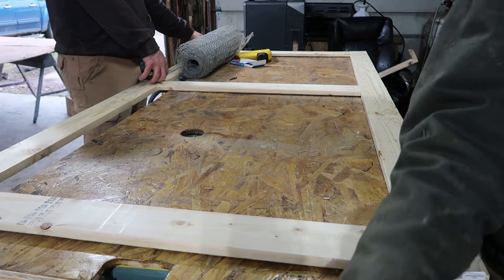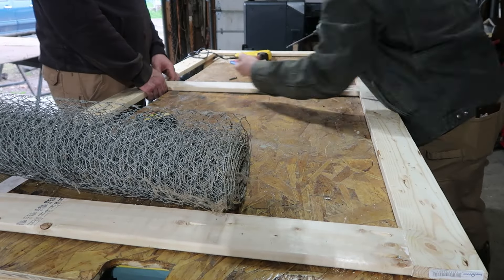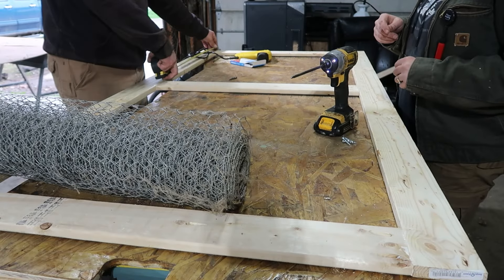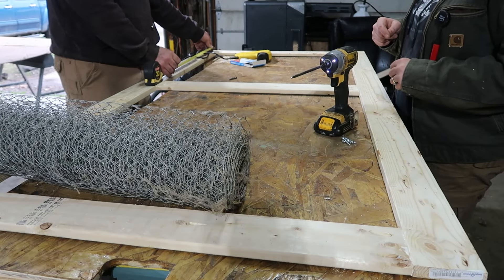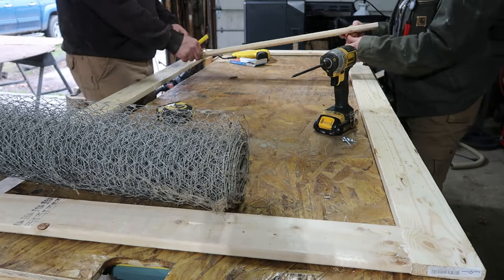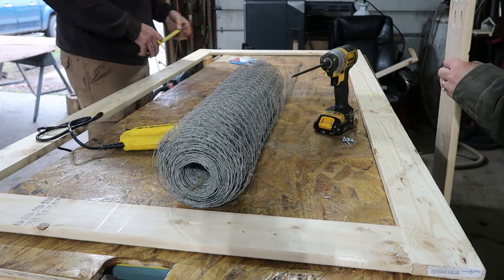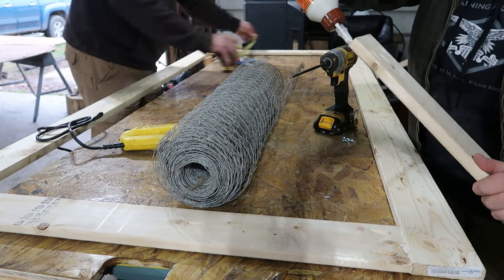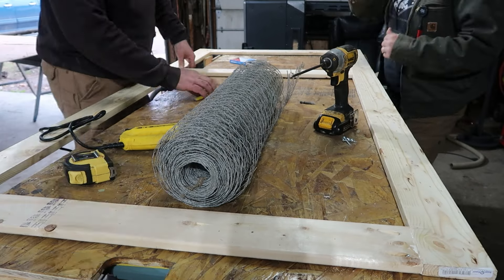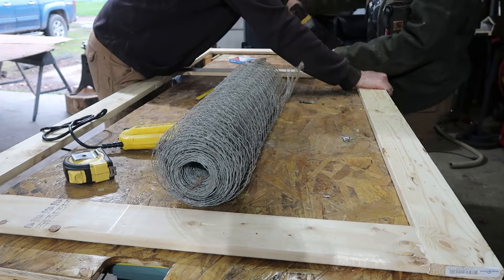Here's where we actually move that centerpiece — we were going to use something different on top, and then we remembered we have this roll of chicken wire. So in order to make the chicken wire work, we ended up moving that middle board so we had it at the right place to staple. We glued it again, re-screwed it with the Kreg screws, and then we're going to attach the chicken wire, which is going to be the screen top for us.